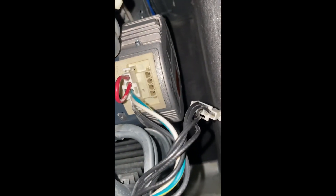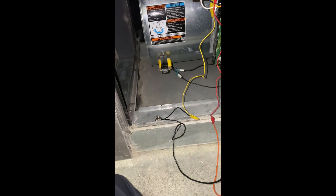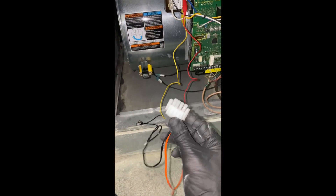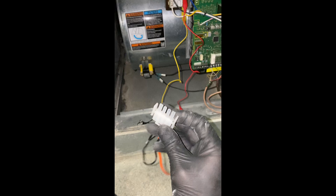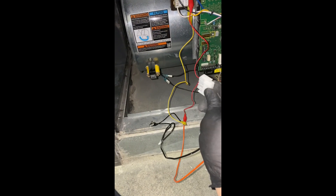I have a new motor installed — this is a go/no-go test. This is the adapter I made. I'm going to put 24 volts through this toggle switch to these two pins. It's going to plug into the motor like this.